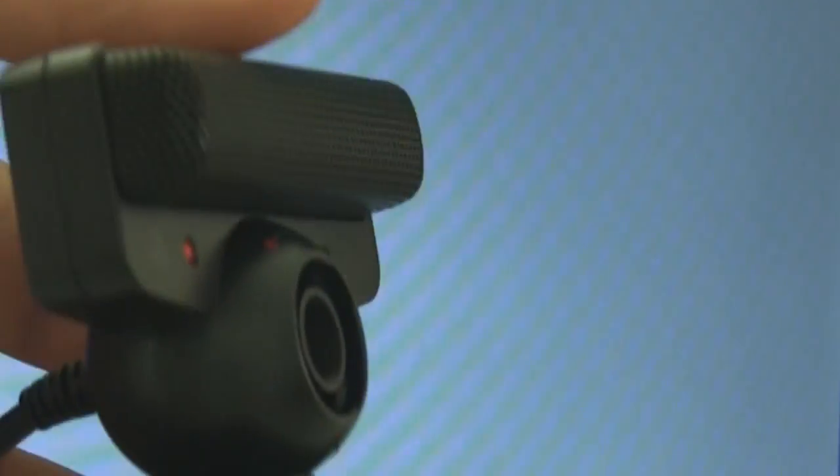This is a video output from an M12 setup with an M12 lens, filter, and mount. You can simply focus the image by turning the lens, allowing any field of view to be perfectly focused. You can change the field of view by adapting different lenses. This is a higher distortion 2.1mm lens, which is why the edges are curved.